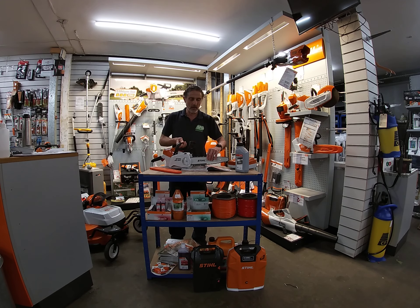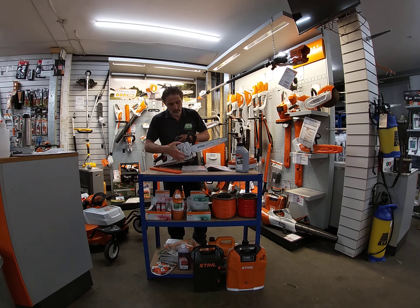As you can see here it's a bit sloppy — that's too much slack. It needs to feel like an elastic band with a bit of spring. With this tensioner I can adjust it with my thumb until it feels perfect, with a nice spring to it. You don't want it too tight because when you tighten the outer casing it pulls the bar out a little bit more, adding more spring. Also make sure the chain is pointing in the clockwise direction — otherwise it won't cut. With the oil coming through, it will run around and keep the chain lubricated.